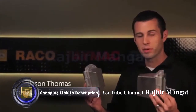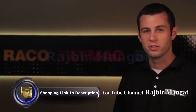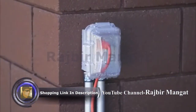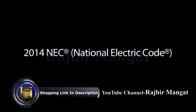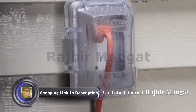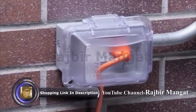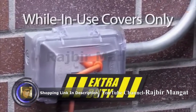The MM420 and the new Jumbo Depth MM720 are designed for weatherproof protection while an outlet is in use. Unlike a common flip cover, a while-in-use cover can have a cord left plugged in and remain weatherproof in wet locations. The 2014 National Electric Code has new requirements that affect what type of cover can be installed on outdoor 15 and 20 amp receptacles. Basically, all receptacles in a potentially wet location require a while-in-use cover, and it needs to meet the new UL extra duty rating.